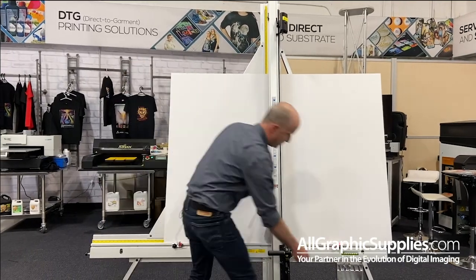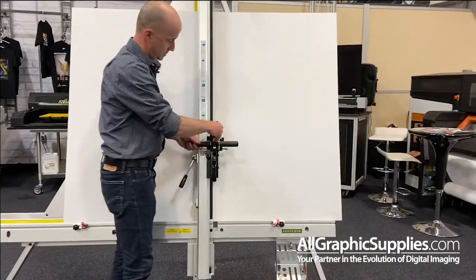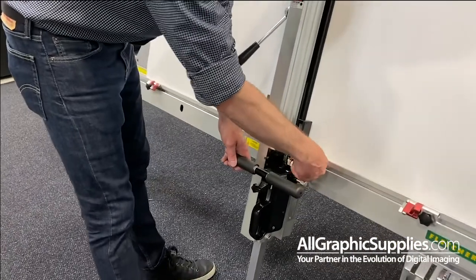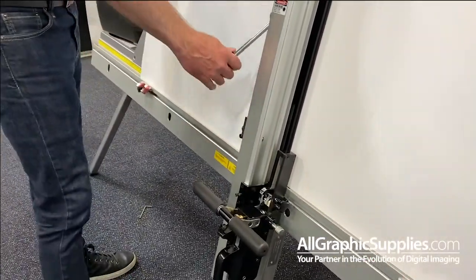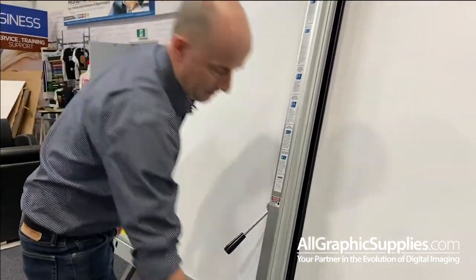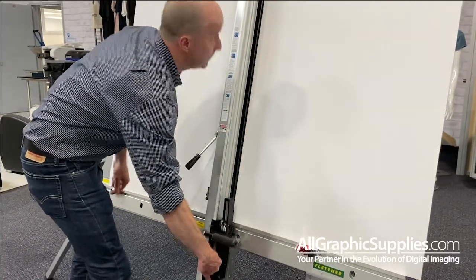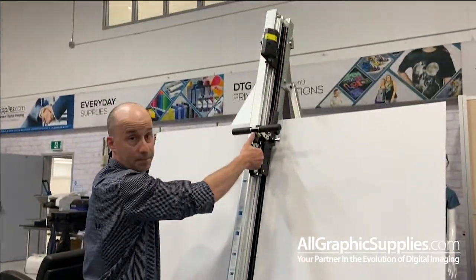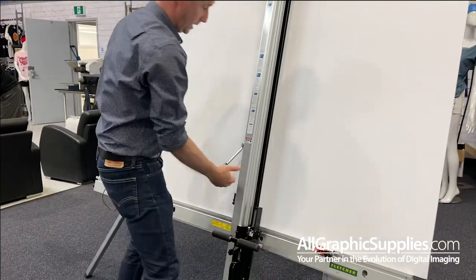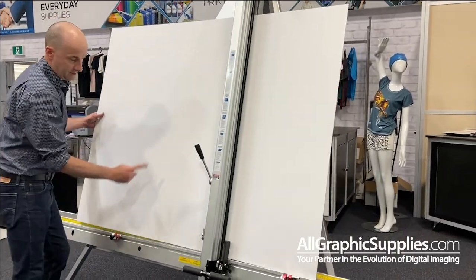Now what I do is I take my 1/2-inch blade and put it into the cutting head. And make sure that my material is clamped in with my clamp. And I'm going to make just a little slit about 2 inches at the bottom, and then I'm going to make another slit at the top 2 inches. Bring your head down, and then I'm going to unclamp and take the material out and then flip it around front to back.